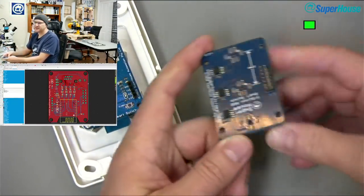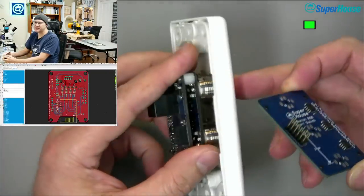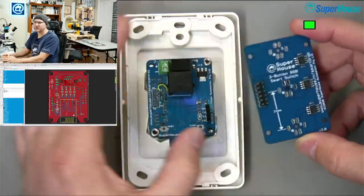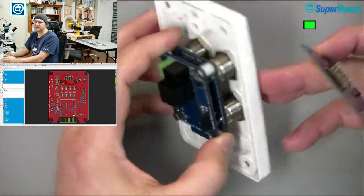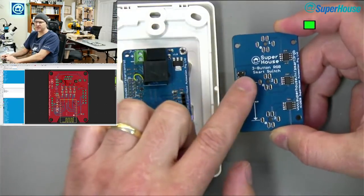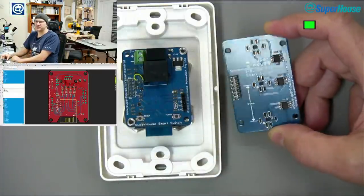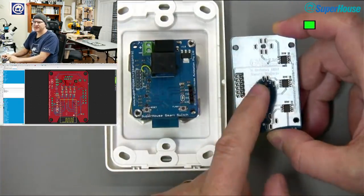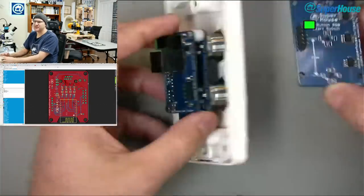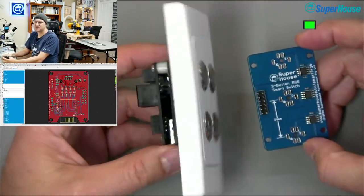This is the board that goes in the back of the light switch. We've got these RGB buttons that mount through a regular wall plate, and then they solder into the carrier board. This carrier board is a three-button carrier board — you can see the one already on here is a four-button, and I've also got a two-button version. If you wanted to make a single button light switch, you could use a three-button carrier and only populate the center position, giving you the option of one, two, three, or four. I wouldn't use the three-button carrier to make a two-way switch because the gap between them is too big — it would look a bit silly aesthetically.